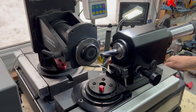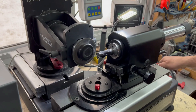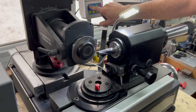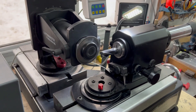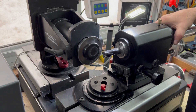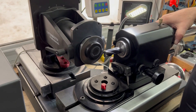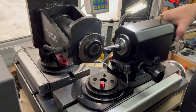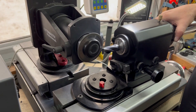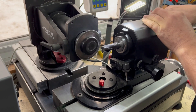Now we're just going to touch up the secondary here. While we're at the secondary elevation and when he's in the center, we're going to gash flutes one and three. Now we're going to take a look at the secondary elevation.